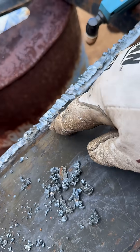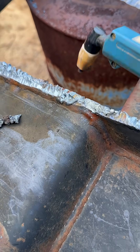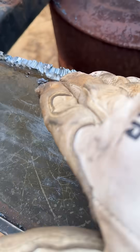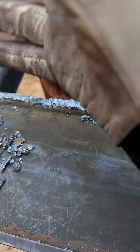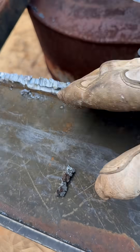Now the problem is, if you get — like I've got here — I'm really at the capacity of this little plasma cutter. It doesn't melt all the way through; it kind of blows it and goes all over the place and comes back at you. But we got it through. This is what I'll call a sever cut, not a clean cut — a sever cut.